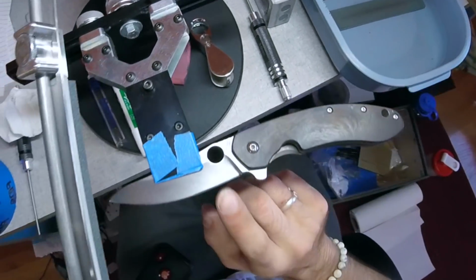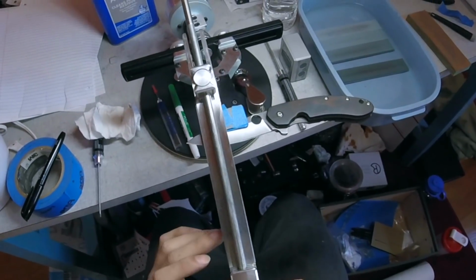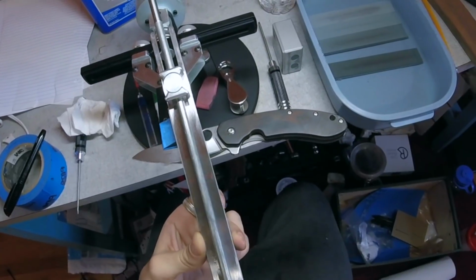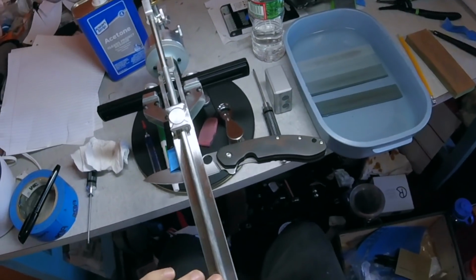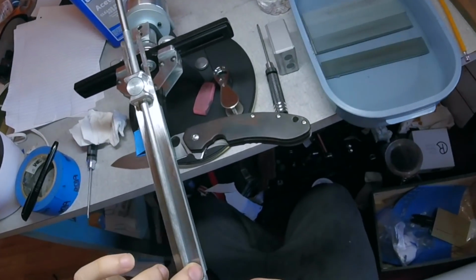And the reason for that right here is that there's just a slight belly. So similar to out here, the stone isn't making full contact. It's not perfectly flat. There is a tiny bit of wiggle. So you just need to manipulate that, but what you're not doing is using the corner or pushing hard, okay?